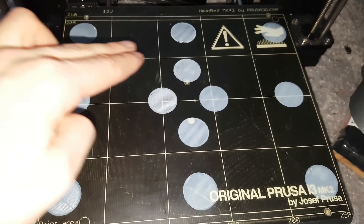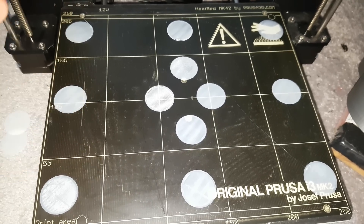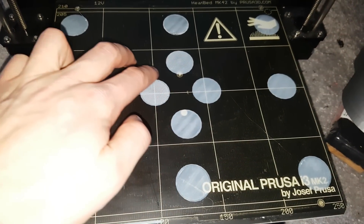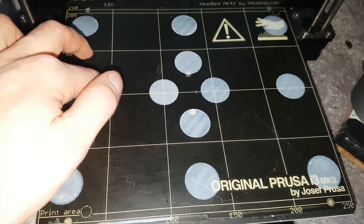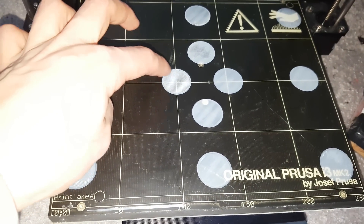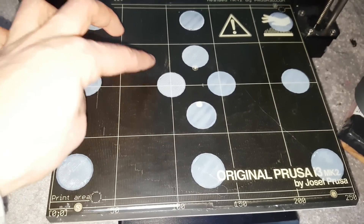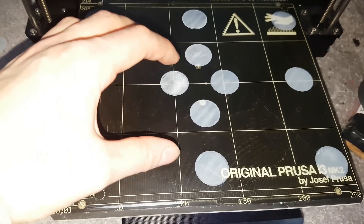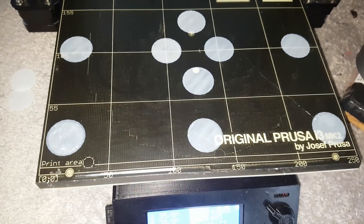There's something in that middle area which is causing that weird pattern — it's obviously not under extrusion, I just don't know what it is. I can't feel that it indents there, though it's probably about 50 microns worth of difference. It seems like the issue extends around a particular zone and then stops — it gets nice again around the edges. At least now I know not to have the edge of a print in that area because it may cause warping and lifting.